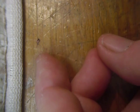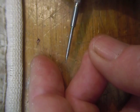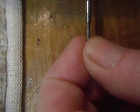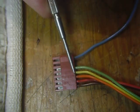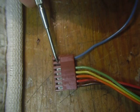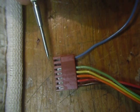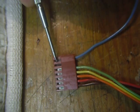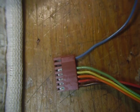I'm not able to show all that — I've got a macro lens on this camera and it's permanently fixed on a little stand. I just wanted to tell you what I did to those connectors to reestablish the connection and what a strange, hard-to-find problem that was. Spraying some freeze mist on this connector caused it to make connection and the radio would start working, so I was sure it was the pin soldered into the circuit board that was bad — but it was not. It was these little pins where they are crimped on the wire. Really weird. That's it, guys — just wanted to show you that. 73s and good DX.